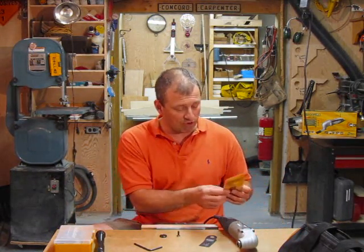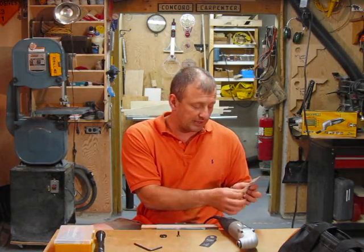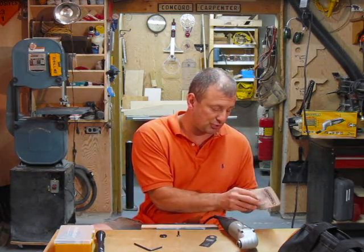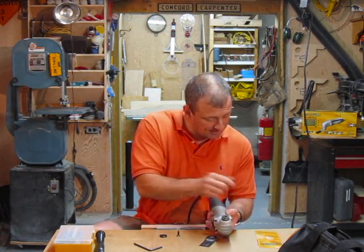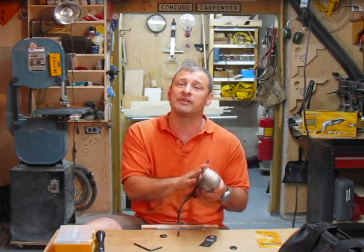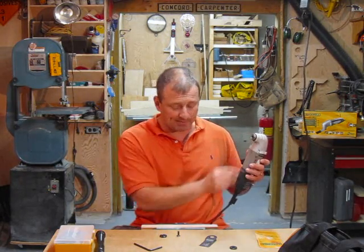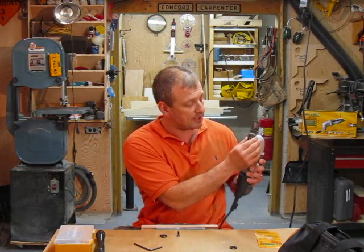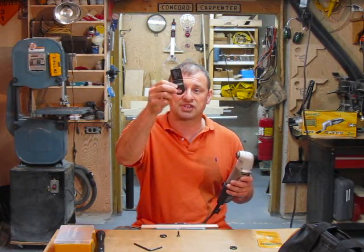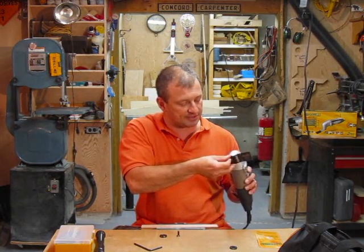The other thing that Rockwell sent us was this accessory adapter. The adapter allows you to fit onto the tool so that you can take other brands' blades. I think it's Fein, Dremel, and Bosch blades will fit on this. That gives you more options for cutting. It's got this hexagonal shaped receiver, and that's how the blade actually locks on, and the blade has kind of a star shaped or an asterisk type shape, and you can maneuver it on the hexagon to get the desired angle.